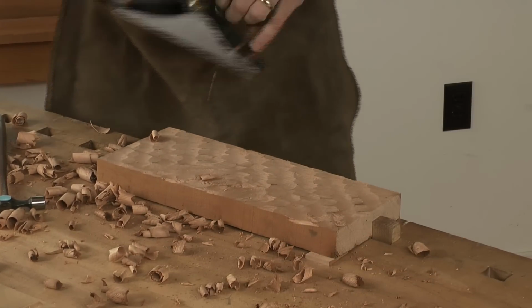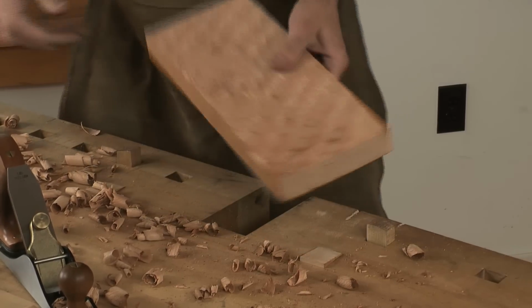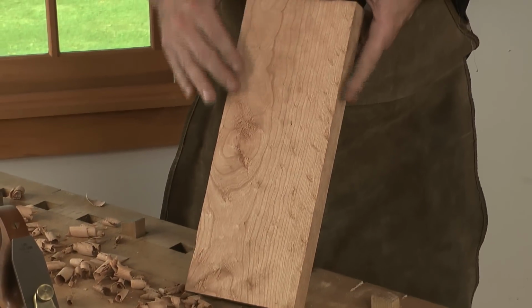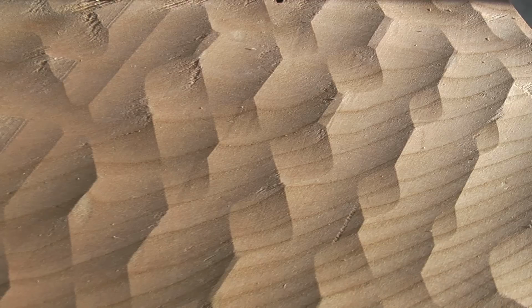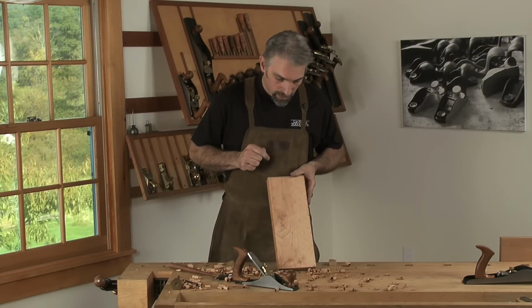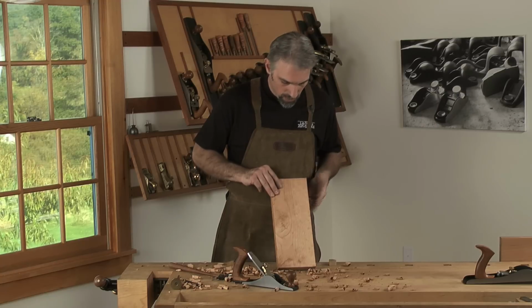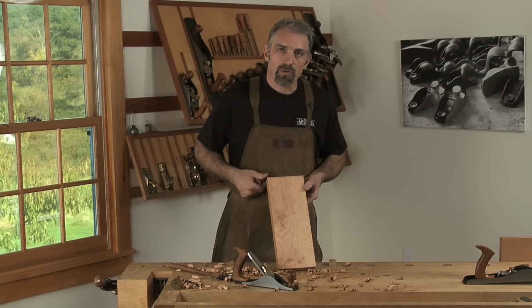I've gone back across there from the other direction, because if this piece is cutting more cleanly, you may actually want to use this textured surface as an effect in something like a door panel. In these areas where the tear out happened badly, that's where I might go to something like the tooth blade to clean it up, or working at a 90 degree across.